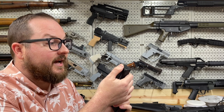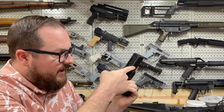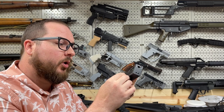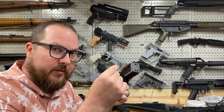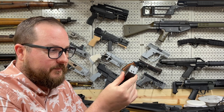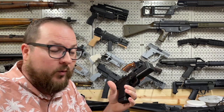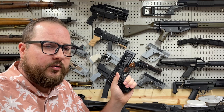The big one is obviously this printed standoff device — making sure it stands up to durability testing. Thus far, this one has. It's kind of interesting — you notice it doesn't have any cross bolts in there, because that would add extra bulk. Instead, it screws in through the front. It's a very tight fit onto the rail itself. There's a standard Picatinny rail here, but it slides on and then is actually screwed in through two holes that are printed in the frame. However, those holes aren't visible — if you don't drill them out a little bit first. I put a one-millimeter skin on the front, so if you decide to print the frame but you don't want to run the standoff device up front, you don't have to, and it won't look like it was ever supposed to be there. So if you have any good suggestions for a name for this guy, drop them in the comments, because the G1926 is boring and we can do so much better than that.